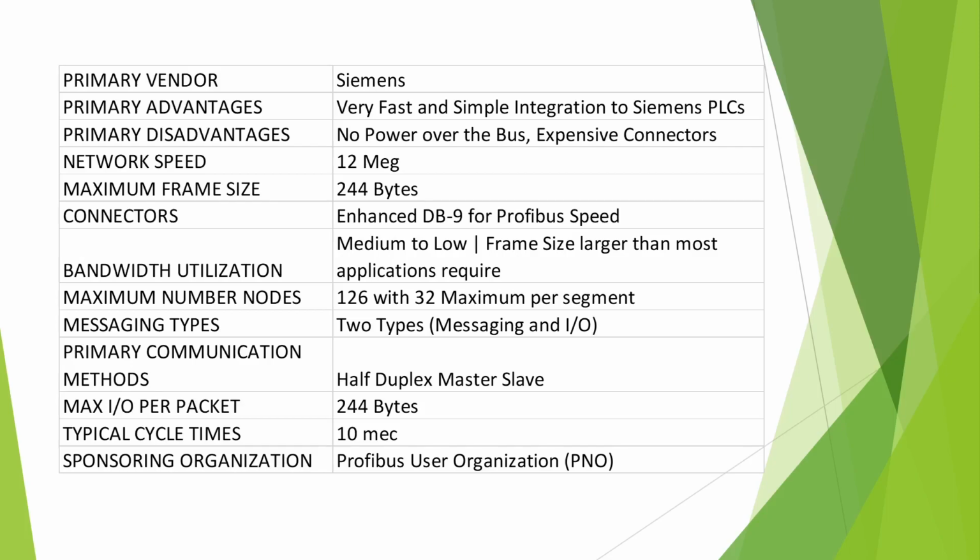If I say the word duplex, what does that mean to you guys? Right. Duplex means that you can have bidirectional communication happening at the same time. So if you have half duplex, that means only one device can communicate at a time. So that is a big thing to think about. Serial communication is full duplex. You have a send and a receive line. So you both can be sending information at the exact same time and not have data colliding. Where a lot of these bus type systems are not full duplex, they're only half, because only one device is able to occupy the communication lines at a time, because they're sending a message out. Normally it's differential signaling, that's why there are 2 wires there.